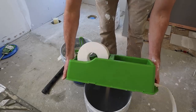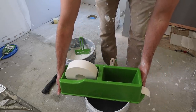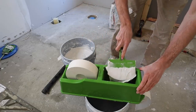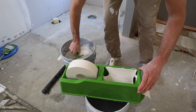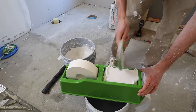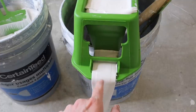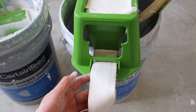Once you get your tape through, you might notice that it's got these handy little notches right here that help it sit on a bucket — that helps when you're pulling it to hold it in place. So I'm just going to fill this up. When pulling the tape out, you'll notice that it leaves more mud in the center, which is great for helping fill the joints, and there's still just enough on the edges to avoid edge blisters.